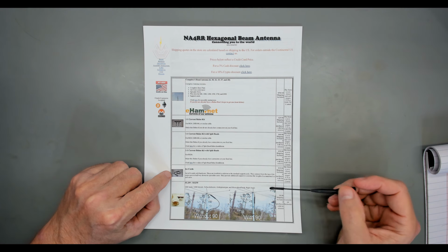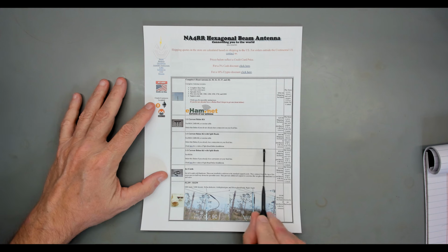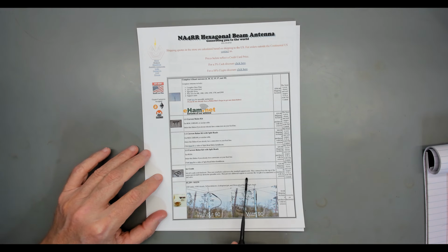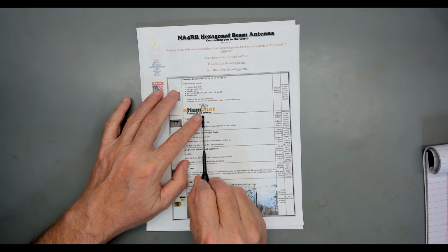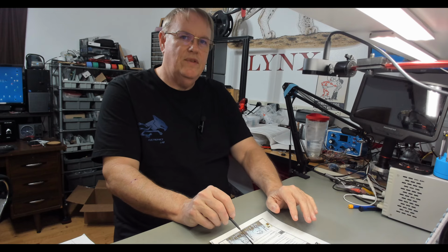I recommend going ahead and paying the extra 38 bucks to put the ice cords on, even if you're not in a heavy icing area. And the reason for that is the cords, if you notice, run across from the top of the post over the tip of the fiberglass rods. They run from the top of the post over, and your fiberglass pole arcs up and it hooks to the end. These come off the top as additional cord and run down to the middle of the fiberglass pole. Just gives it more rigidity.